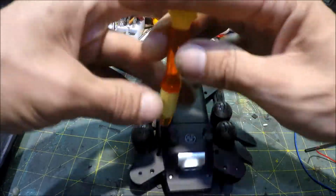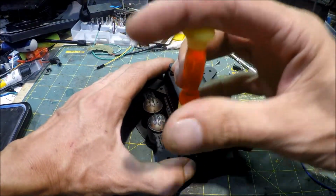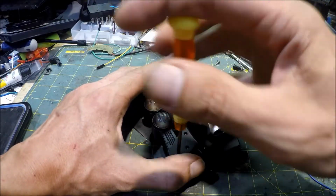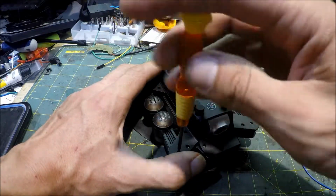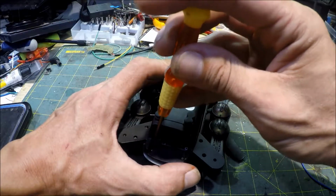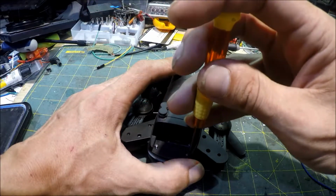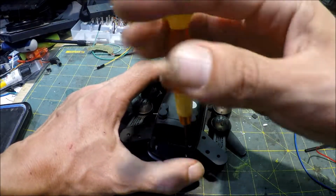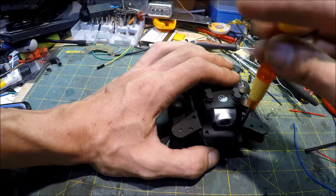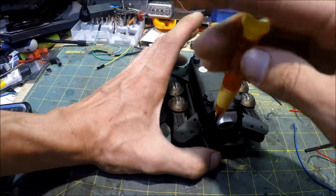But yeah, these drones, they're cheap, yes, but the GPS modules in them, I've had some really good luck with them. The one I got out of a SYMA drone, the GPS module in it is totally beating my GLONASS TBS M8 module. It'll pick up like 12 to 14 satellites at a time. It's crazy. I usually only get like 8, and that's just from a cheap drone. I think I got this one for like $25 shipped to my house, and you can't beat that even if it is used. And it's more fun if it's used, because then you can see all the crazy shit that people do. But almost there. Holy crap!